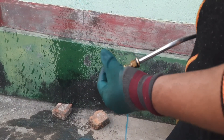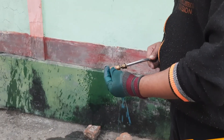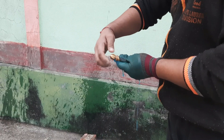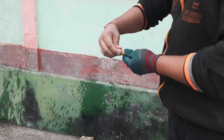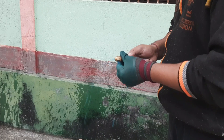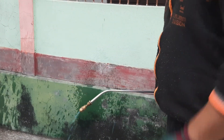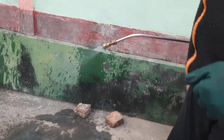Now we put the nozzle head cap back. After putting the nozzle head cap back, make sure it screws well and doesn't come out while spraying. Make some adjustment in the nozzle body so that the nozzle head cap adjusts nicely — a bit of screwing and unscrewing with the nozzle cap on the body. Now spray it. See that the liquid is coming smoothly — that's how it should be working. This is the perfect way it should spray. This is how we are all done.